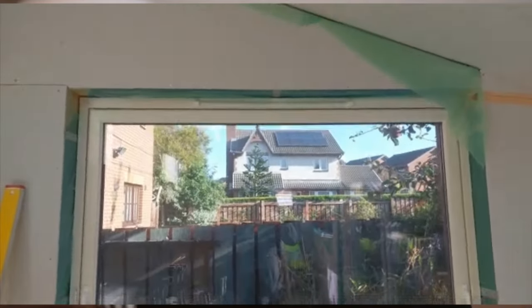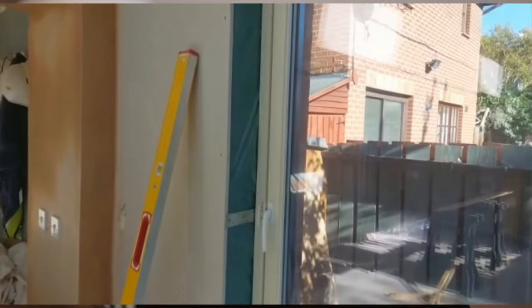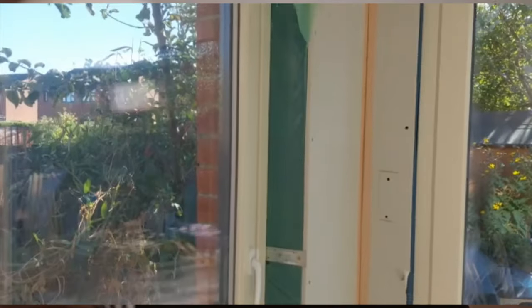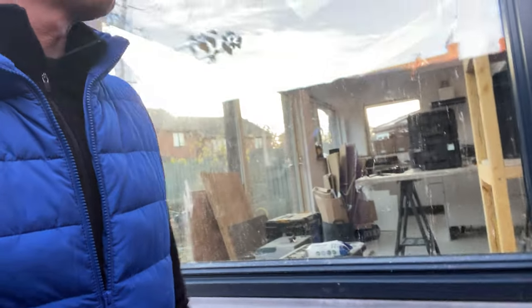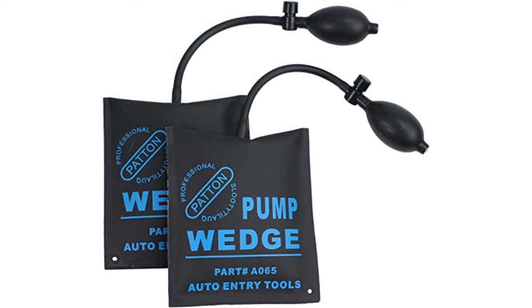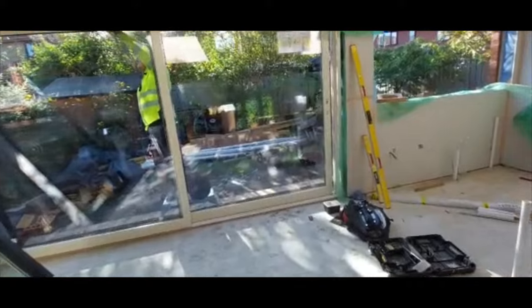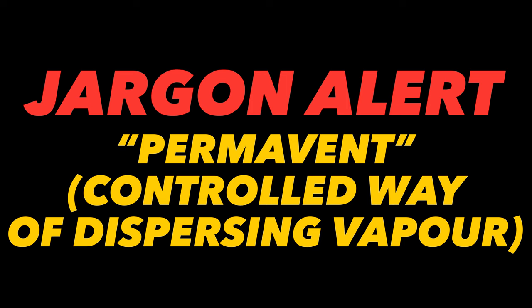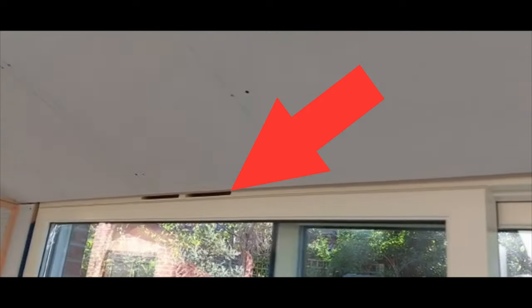Because we've gone for a timber frame, fixing the windows is a straightforward affair. I size these windows with 5mm around all four edges of the structural openings — so 10mm in total to play with — we call that tolerance, and it helps us to manoeuvre the windows in. We use plastic packers with the help of inflatable air pads while installing, and note the requirement for permanent vents within the head of these windows: since we're wrapping the whole thing in polythene for our vapour barrier, we need to let the vapour out in a controlled manner, and this is how we do that.